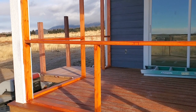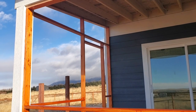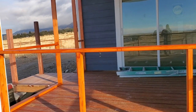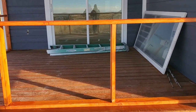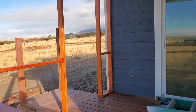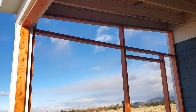Next day here - I had to stop yesterday a little early because it got too windy. But as you can see, I got the frames put up. It's just a simple process: put the frame around the outside, have this little center rail there and some supports that help strengthen the screen on the bottom. And I have the doorway framed out for the 36 by 80 door with a little top piece there.